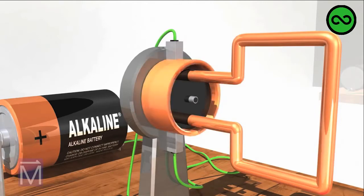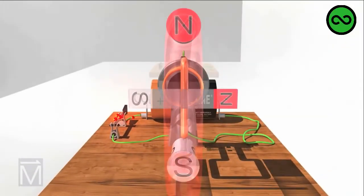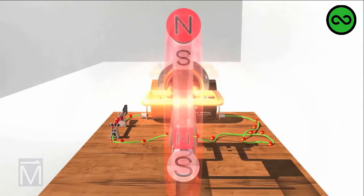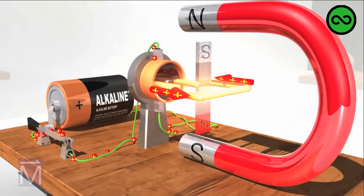To see why, we'll temporarily replace the commutator with this copper ring, which has no gaps. The bar magnet again represents the magnetic field generated in the coil. As you see, this is still not much of a motor — the interacting magnetic fields caused the armature to move, but only to the point when their fields aligned north to south, and there they stayed: opposite attracting opposite, two magnets stuck together.